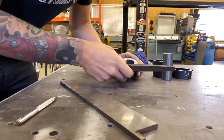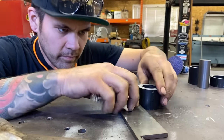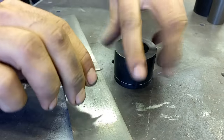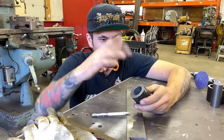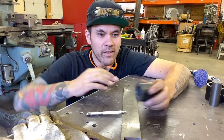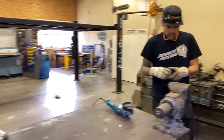The main challenge is grinding the bevel perfectly and getting everything to slip together nicely. To mark the taper, I'll come up a quarter inch from the three-eighths edge — that gives me the angle. It's more artistic than precise. I'll scribe a line all the way around, then remove the bulk of material with an angle grinder, staying away from both edges.